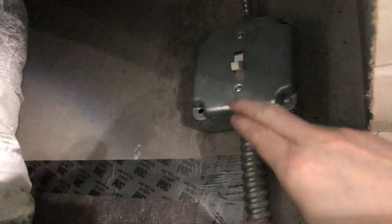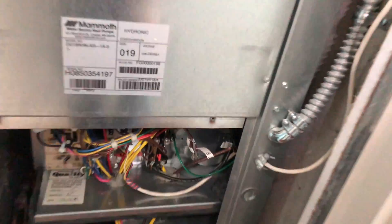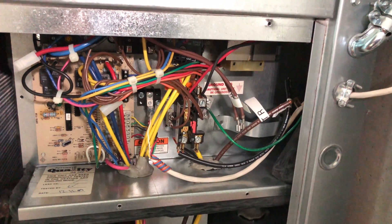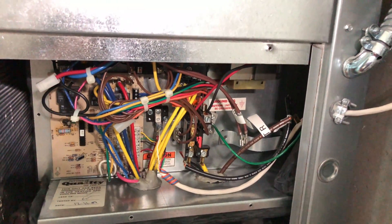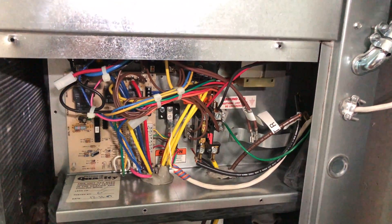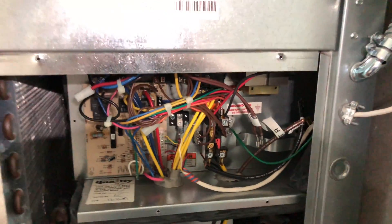Before working on this, power is off at the cutoff switch. I checked the capacitors with a multimeter after leaving it off for a bit to confirm no voltage, and in addition I bled them with a bleed resistor and then shorted them with a screwdriver — just to be 100% sure. Always good to be safe.